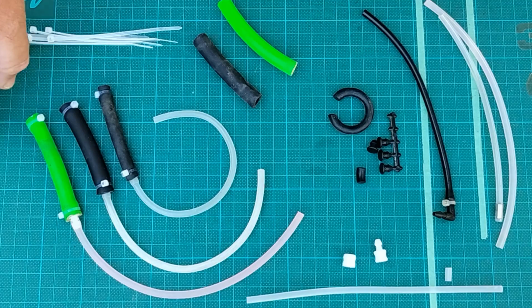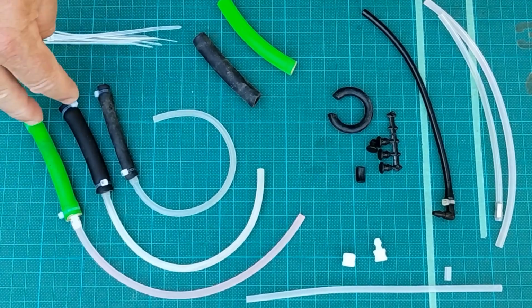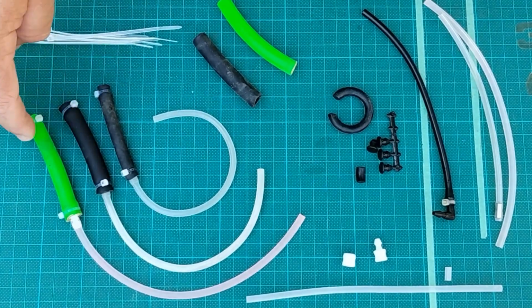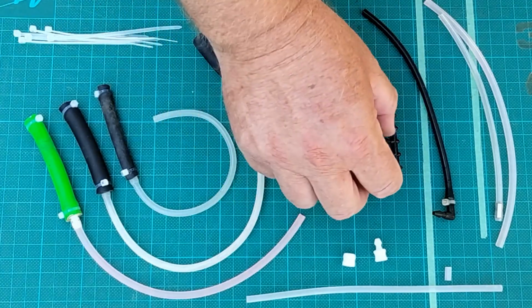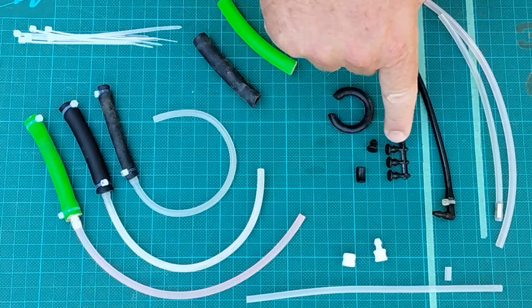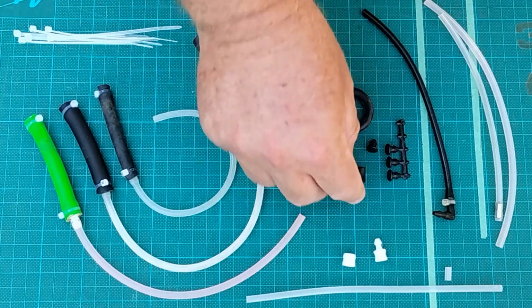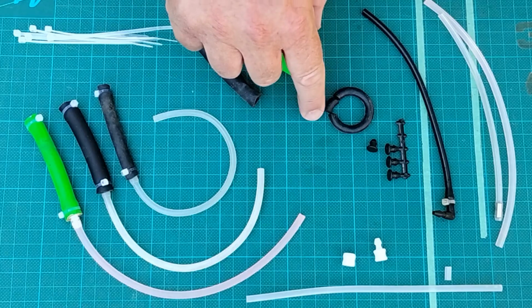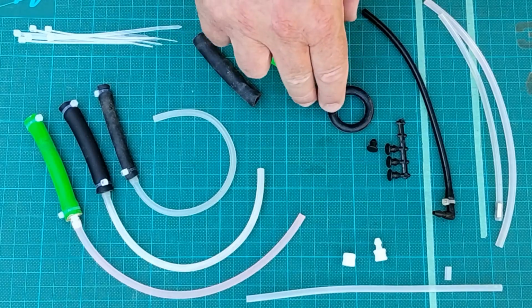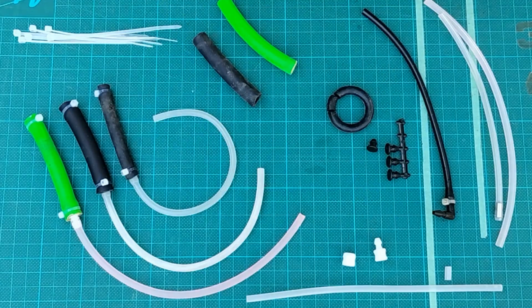Now the hidden parts of the bladder tank are the fittings in each end. So there's a plug in one end, a simple plug that just turns it into a blind compartment, and they are made of various things. Irrigation plugs from a hardware store for garden irrigation, just a piece of rubber O-ring around about 6 millimeters in diameter is another good one, or custom made plugs for different sizes.